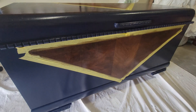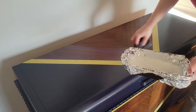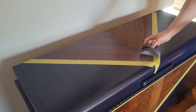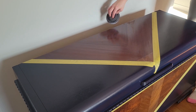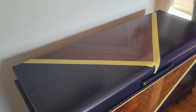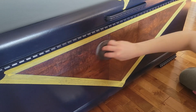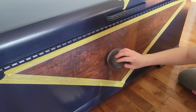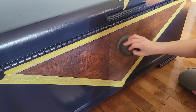I let the stain dry for about two days before applying my top coat. I'm using Varathane Diamond Wood Finish in satin, doing about two to three coats. I don't think this is going to get very much use since it's just a cedar chest blanket box — I'm not going to be using it like a table. I'm going with the wood grain as best as I can to minimize streaking. Since this top coat has really low odor, I decided to bring the cedar chest inside to apply it — there's less dust inside and I don't want it on my finish.